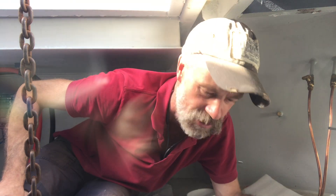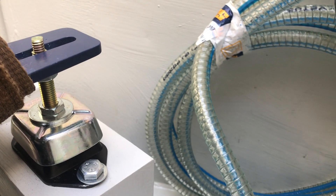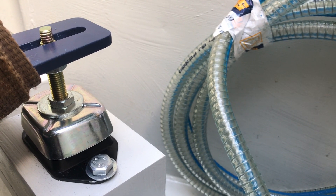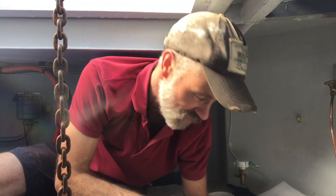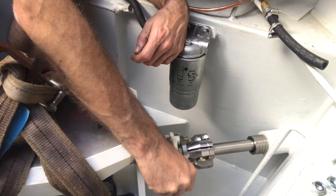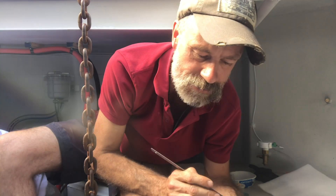It is a hitch, but not a total disaster — I hope not anyway. After all the faff and help from Coalcraft getting the engine lifting blocks done, I find to my horror that they're probably just a little bit too short. I'm past the margin of where they need to be. Basically my own fault: while I measured carefully and multiple times, at one point I was measuring by the stern tube and the other point up here, stupidly assuming the floor was a straight line — and it's not. I'm about a centimetre out.